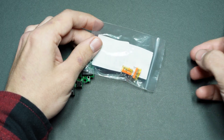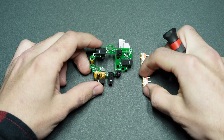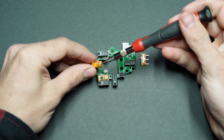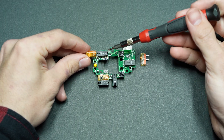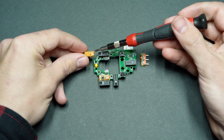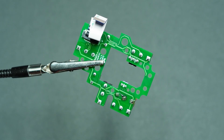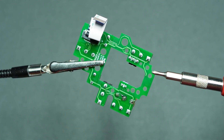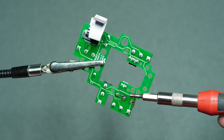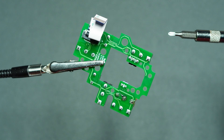I've been using mine for almost a year with no issue. The left click switch is normally guilty for the double click issue, but given I've already replaced it, I'm replacing the right click today just for demonstration — it's the same exact process no matter which switch you're replacing. To remove the old switch, flip over the board and identify the three metal pins going to the switch: these three pins for the left click, or these three over here for the right click.